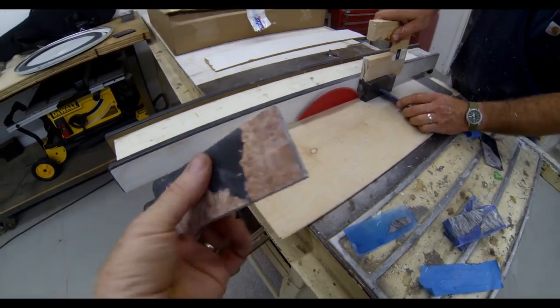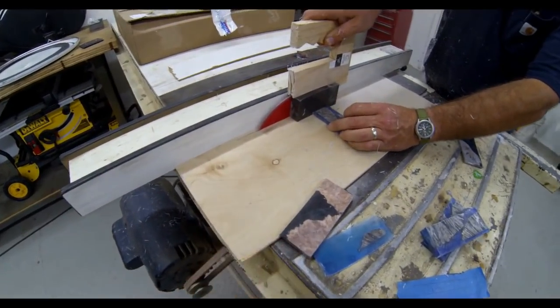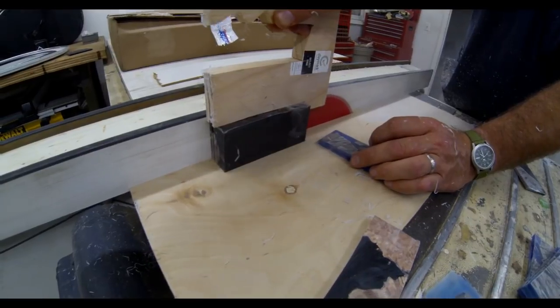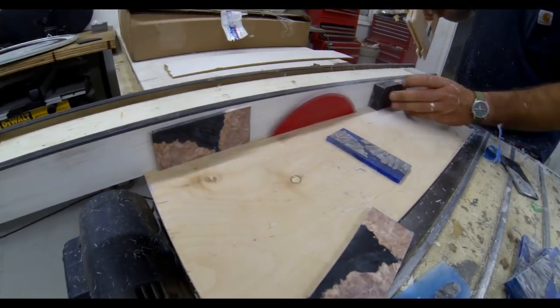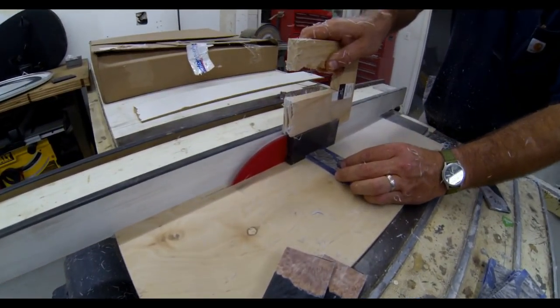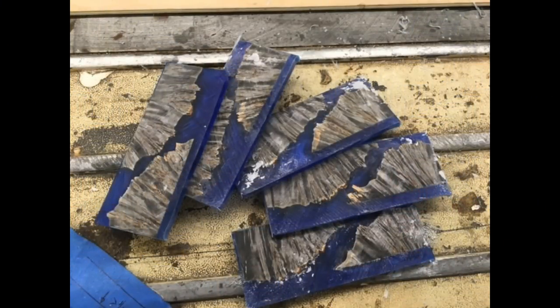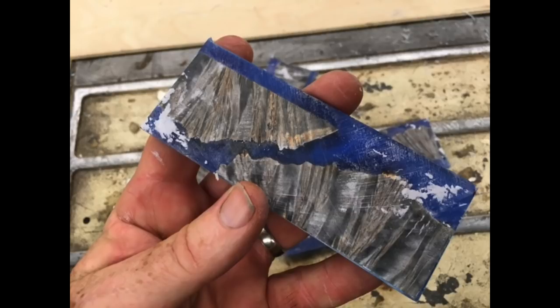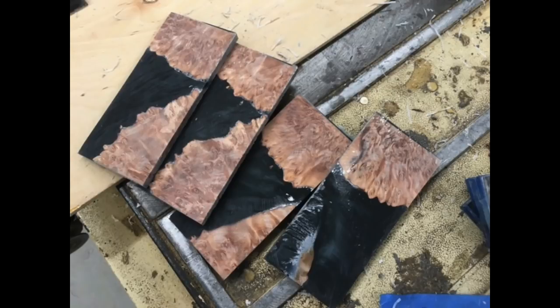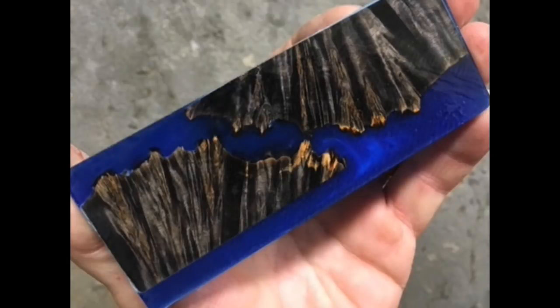The first thing I noticed is that the blue one came out really nice. The black — or darker — one, I have a little bit of a problem with. There are some bubbles, not in the middle of the Alumilite, but actually where the Alumilite meets with the stabilized wood. Even though the wood was stabilized, it still had to have some moisture — that's definitely a moisture problem. The blue came out absolutely great; not sanded or polished at all, it will look absolutely beautiful. The black one, a little disappointed — I think I can still salvage it by filling in those bubbles with a little bit of epoxy.